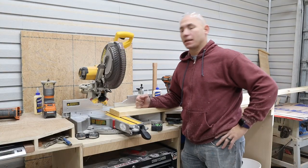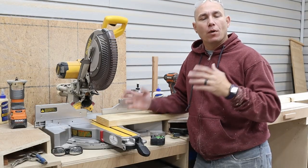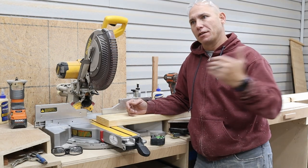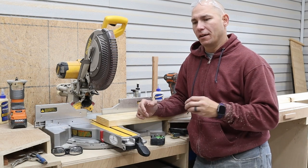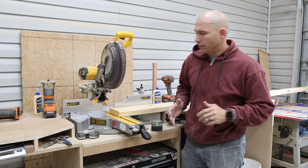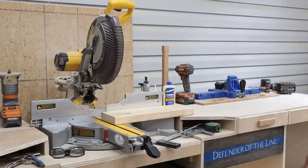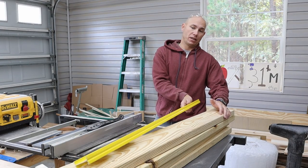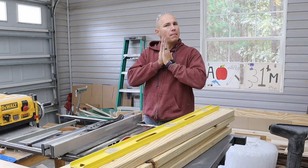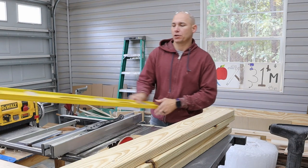Now it's time to build the top. I'm just going to build it out of common two by sixes. I want the top 50 inches, but I'm going to cut them about 51 inches so that once it's all assembled I can take a circular saw or bring it to a miter saw and cut the end off so everything is nice and square and all ends match. That's the easiest way — if you cut them all exactly at 50 inches, it seems like there's always one sticking out a little too much. I'm going to flush this end up and cut four of them. I'm going to do the same thing with my two by sixes that I did with the two by fours — joint the edge with the straight edge technique at my table saw so that everything gets nice and straight. When I put the tabletop together, everything should have nice tight joints.